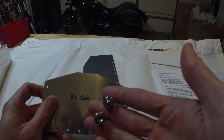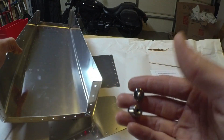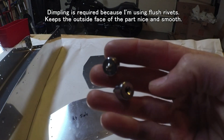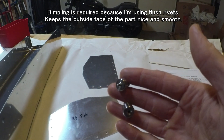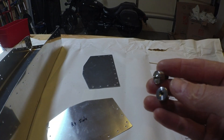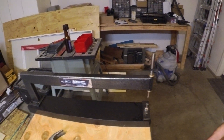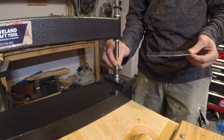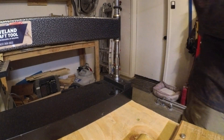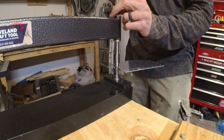The next thing we're going to do is dimple these holes. We'll dimple the end piece and then dimple the part where they're mating up on the toolbox as well, just so those sit in with each other — it'll be clearer once we get done. These are dimple dies — these are little 3/32nds dimples — so I'll fit these into the holes and show you how to get set up with the C-tool. We actually want the dimple to go towards the inside, so we'll want the outside facing up. I'll make sure we get the right side, set this up, and then just whack it with the hammer.